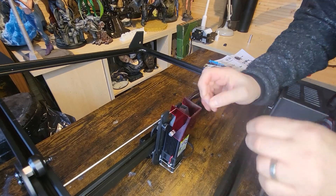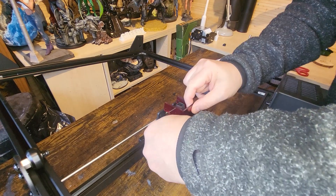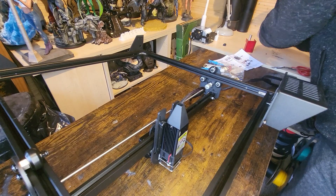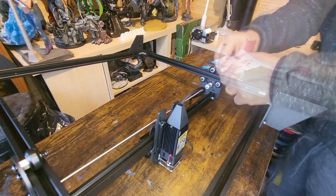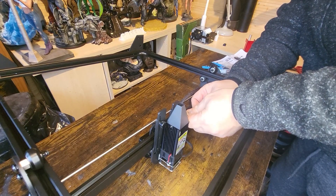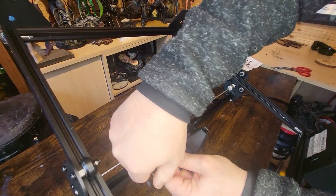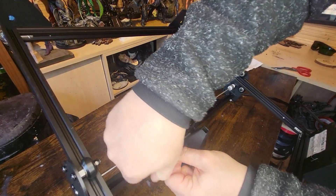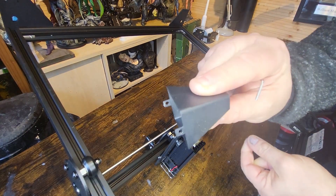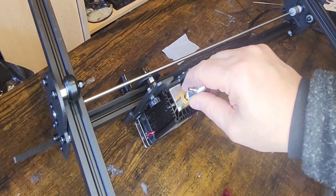Installing it was relatively easy. You just undo a few nuts, then take off the guard that sits on the bottom of your laser and put it to one side - don't lose any of the screws. There's a black encapsulated area that you need to remove, so take off a screw on either side and that comes off. We're not putting that back on, but keep it somewhere safe. The screws that came out, I put back in.